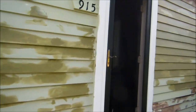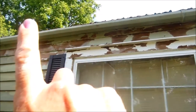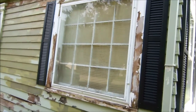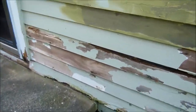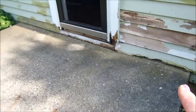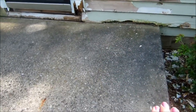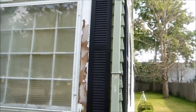On this window we've got some bad glazing that has to come out before any painting. This outer storm window is coming off so we can do maintenance on the outside of the house. The missing support brackets up here caused sagging and water ran down inside the window frame — there's a lot of condensation. That has to air dry before we can scrape, because if you start scraping or sanding into wet wood you're going to gouge it. My kids went right down to the backer board, so this piece has to be cut out and replaced. We also had water damage and wood swelling at the bottom where the board was in contact with the concrete block.